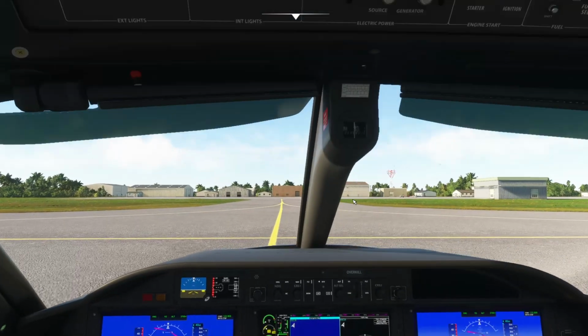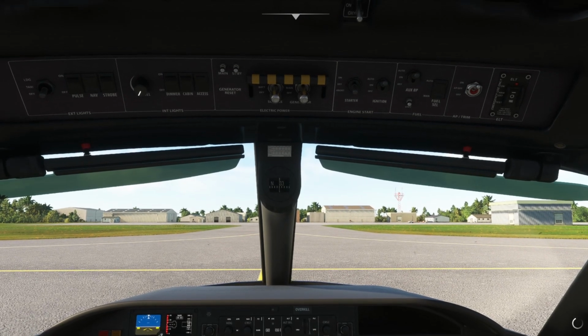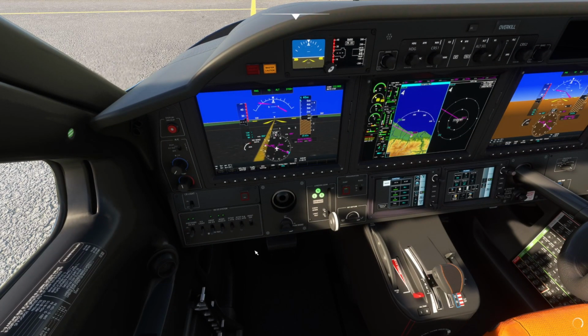And let's see, we got flaps up. We got taxi lights set to the on position. Strobe lights should be turned off. Pulse lights can be turned off. Weather radar, if it was used, is on standby. De-icing systems, except for the inertial separator, can now be turned off.